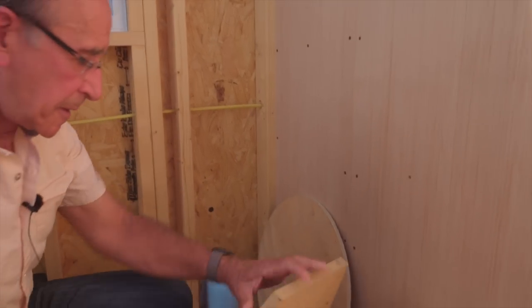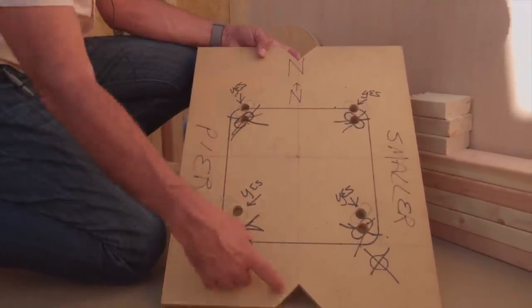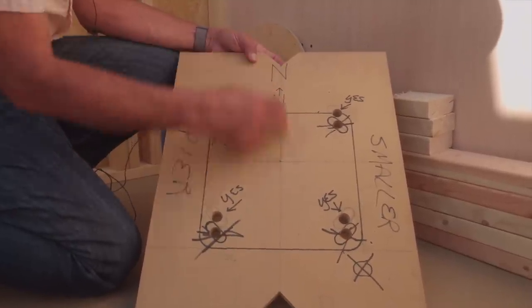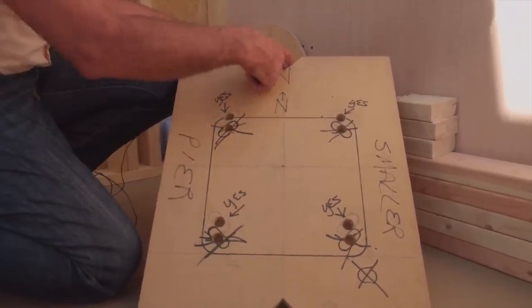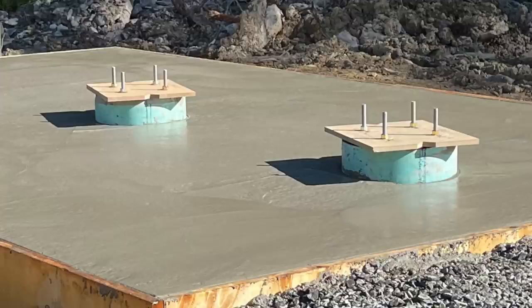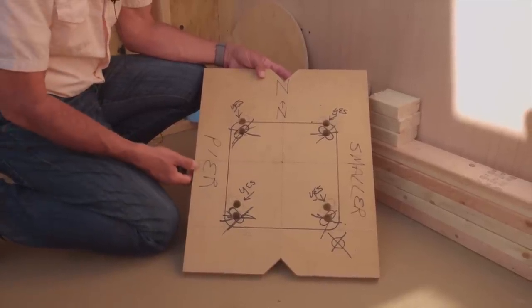This is one of the actual forms that I used to do that pier. What we did was my wife and I came out at night before anything was poured, just when the columns were in, and we marked out where north and south was going to be. We put notches so that we could see, and those notches aligned with the edges of the piers. On the outside of the piers, we put where north and south was, we put levelers in there, and then when the time came, we attached this to the cage, sank it down into the cement, aligned north and south, and that's how we got everything level and lined up. These became really invaluable to working with the piers and setting them in the concrete.